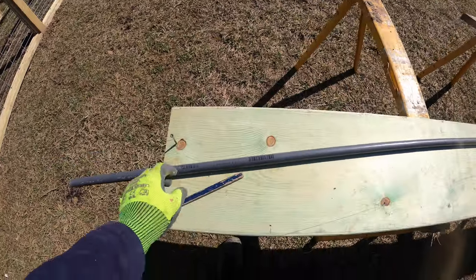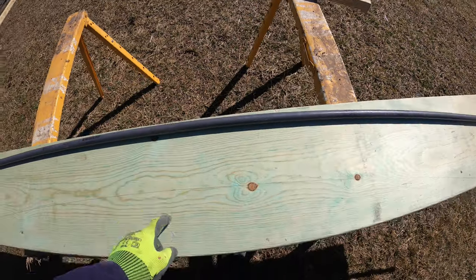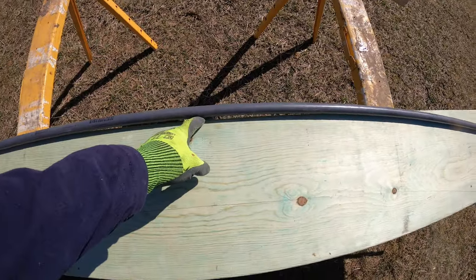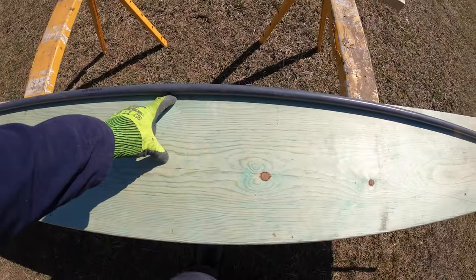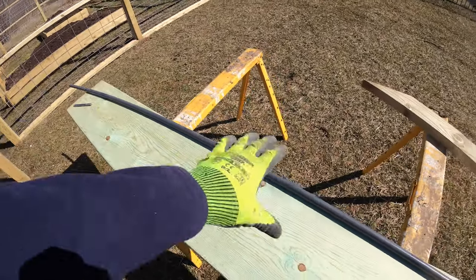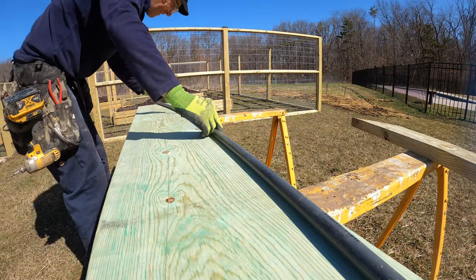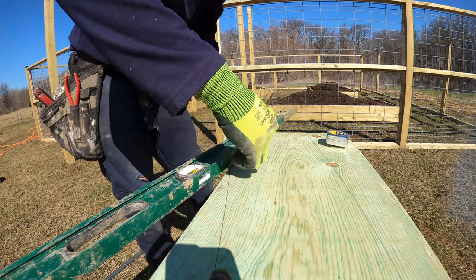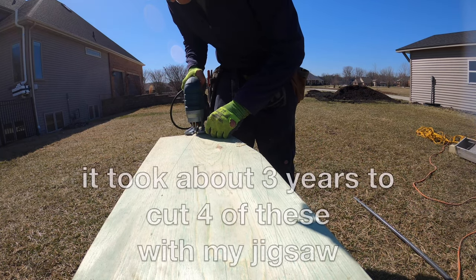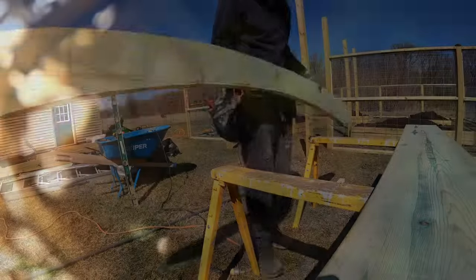Similar to the bottom, I've got my screw four inches down on each side, and I'm just going to push up in the center to mark that - that'll create my parabola, my kind of parabolic arc. It's a little tighter in the middle and a little broader on the outside. You want a little open on the ends rather than that perfect circle wagon-wheel look.